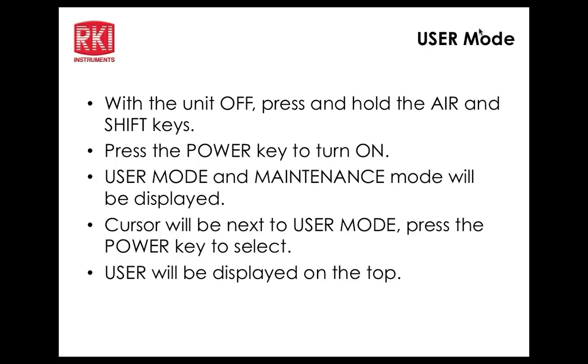Is there an automatic backdoor value, like 1994? Yeah, it would be for the user mode. So I go into password right now. It's off or on. It's generally 006 for the maintenance mode. I haven't tried to set up a password for the user mode. 006? 000. Yeah, we'll look at that right now. In fact, three zeros and a 6, so it's basically the instrument model number backwards. Like it is on the 2012, it's 2102.